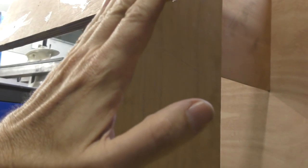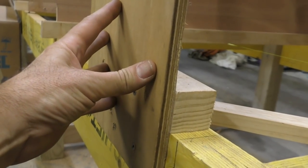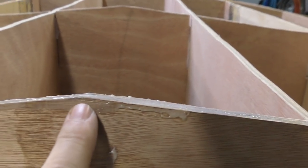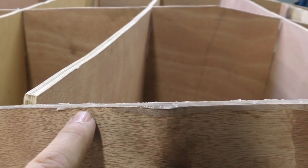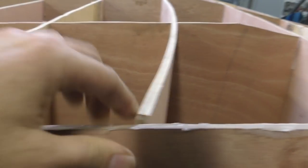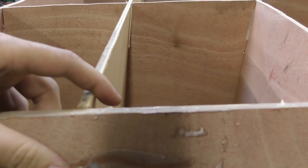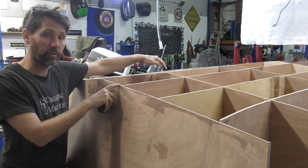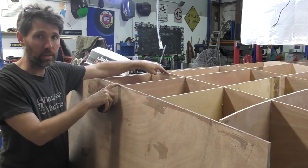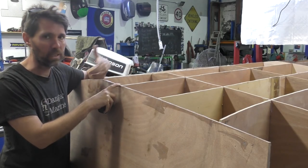The angle is right, but for whatever reason, I could have moved the mount here up a little bit, but it would have meant the screw holes were very close to each other, and it was just easier to do the blocks. Next thing I need to do is mark on the transom where I want the longitudinals to touch before I glue them, because as well as being warped, they sort of move around a little bit. So I just need to make sure they're positioned before I tack them in place. I'm getting these measurements by taking them from the bulkhead at the back here and transferring them to the transom. The bulkhead here is slotted, the transom isn't, so it gives me good reference measurements.